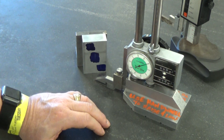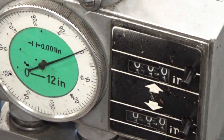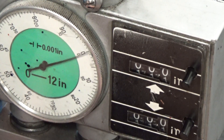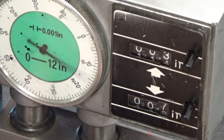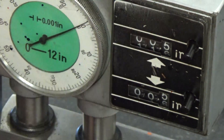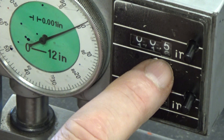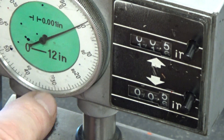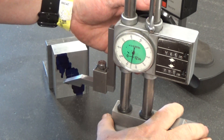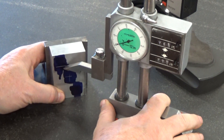I'm going to zoom in so you can watch me move it. Here it is down at the bottom at zero — these have been zeroed. I'm going to move that wheel up: 1, 2, 3, 4, 5 — there's our zero. And this one's easier, just lock it down. It's made five, so that's 500. Each of this one is a hundred thousandths broken into thousandths. We want to move this up a little bit — two hundred and fifty thousandths — then lock it into place and scratch across there.